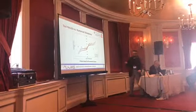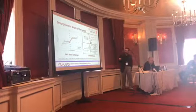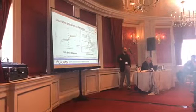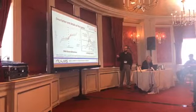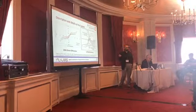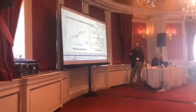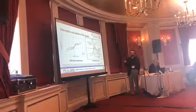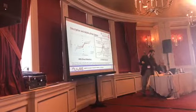practicing engineers, so that they can actually use such a bracing system in design and analysis software, we developed an analysis module and implemented it in S-frame software so that you can capture the behavior of the system using different parameters, including the initial stiffness, the superelastic stiffness, and the different stress points. Also, this module includes the ability to capture the residual strains that may accumulate in the SMA, especially after repeated numbers of loads and cycles. So little by little we can see that the SMA is accumulating some residual strains, and this model can capture these values.